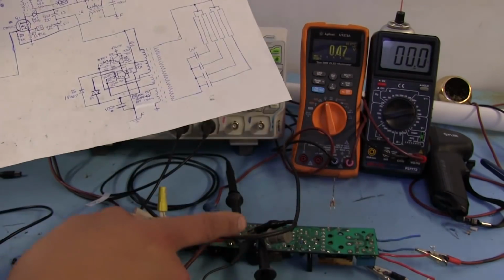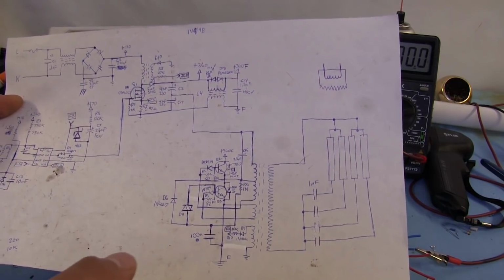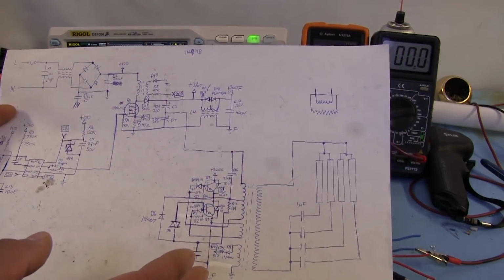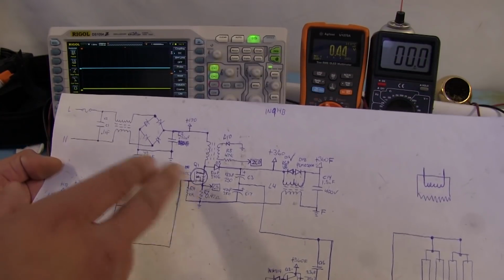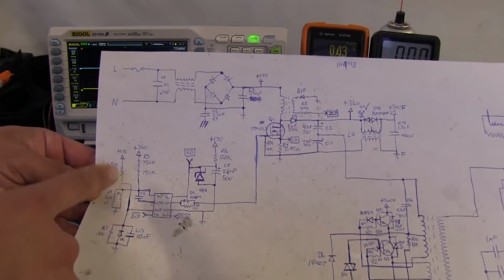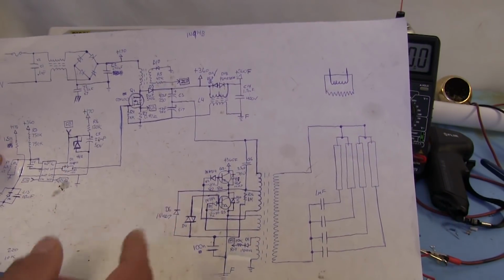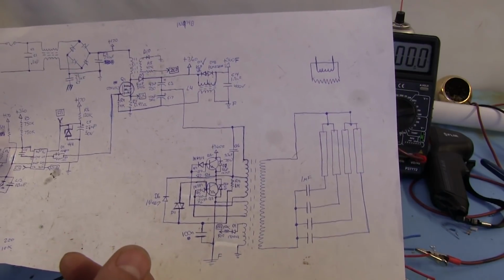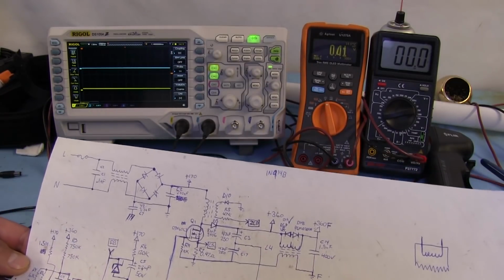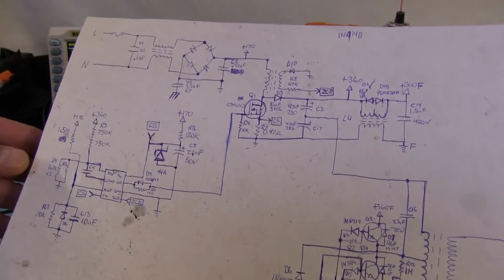So I don't know if maybe the transistors I used are just not adequate. That could be very likely, that even though they're kind of similar, they're not really designed for this particular purpose, and that could be what's going on, that it's just not working. Over here, I pulled out a bunch of other components, and while I was at it, I filled in a bunch of the information that was missing. I can't find any bad capacitors, nothing seems shorted, although if they're leaky, I really don't know. There could be something that's bad there. So pretty much the only other thing I can show you is how I believe the PFC chip here is kind of working.